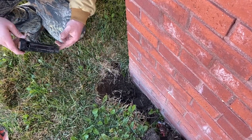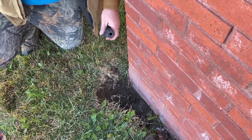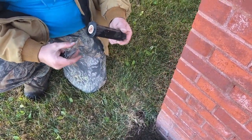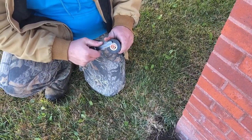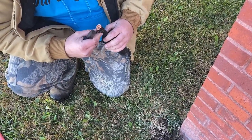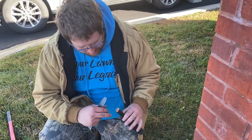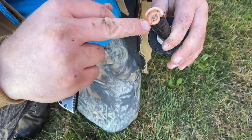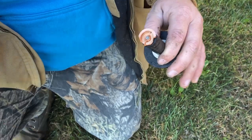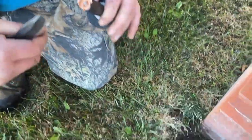There's always going to be pipe connected to the riser and then to the head. This head's busted, so I've got a replacement. If the nozzle's worth saving, try to save it and reuse it. This one's a little busted, but typically you don't want to spray over concrete — what's in there is usually what's appropriate. This one has a four, meaning it sprays a four-foot arc out towards the concrete, since we're coming away from this brick enclosure.